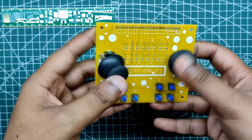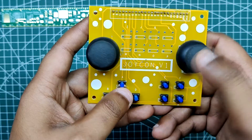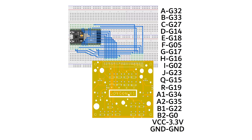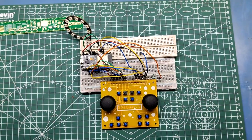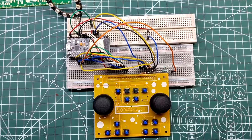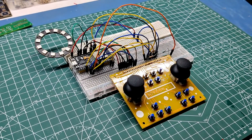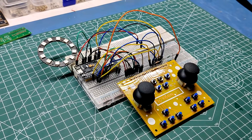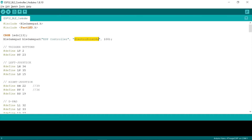Here are the results of this build — we can now use this board to control things or create a game controller. Following the circuit diagram, we connect the ESP32 to every pin on the Joy-Con. There are 12 buttons in total: the two analog stick buttons and 10 regular buttons. Additionally, 3.3V and ground are connected to VCC and ground respectively to power the analog stick potentiometers.